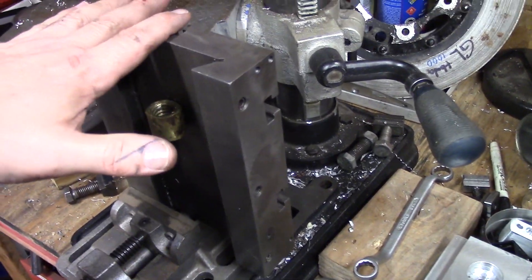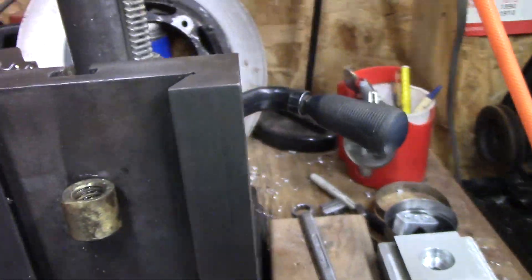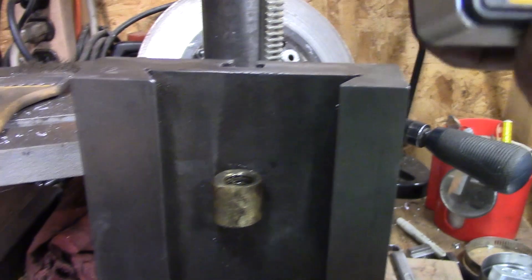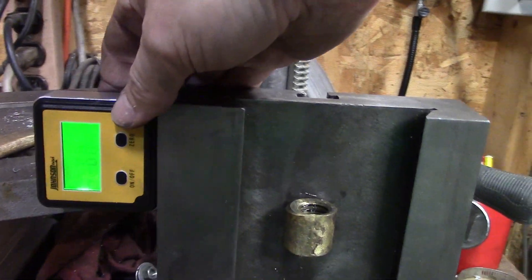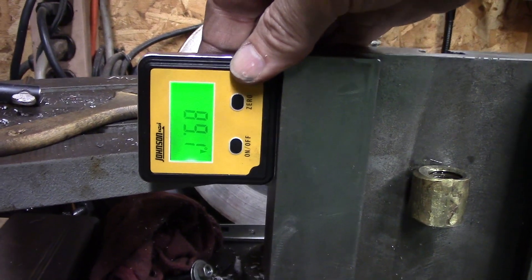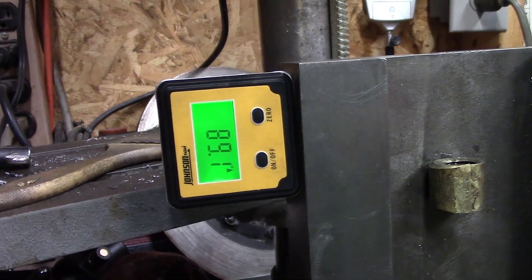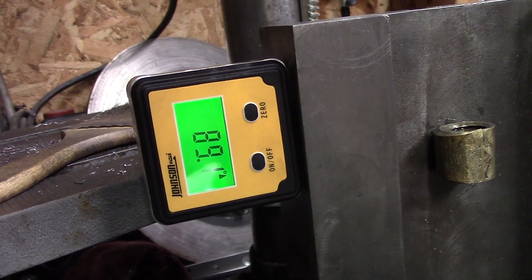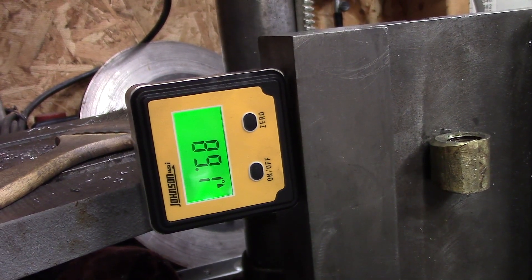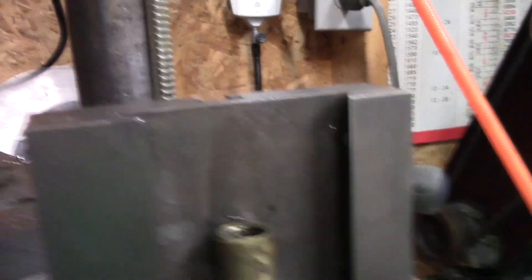My most accurate drill press vise here — it is on the machined surface, bottom surface of the base of the drill press. Got my cross slide in the vise, and then we can see how close we are to the machine. We're going to put our digital level — the machine's digital level is saying 89.1 on that side. Let's clean it, put it back, make sure we're still about the same — 89.1. I'm going to zero that and then we're going to reference it with the chuck.